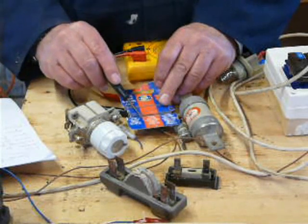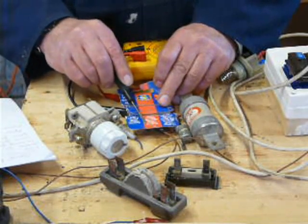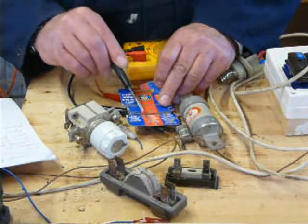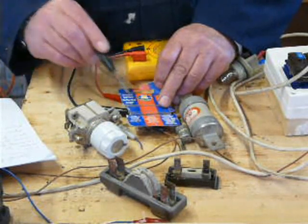That's all we can say about that, is don't get messed up in your head in watts and, oh, have I got some fuse wire that's rated for 12 volts. You don't need to do that. As long as the rated voltage is above the voltage you're using the fuse for, that's fine.